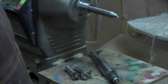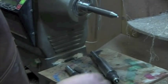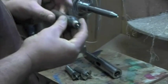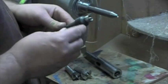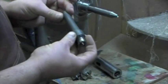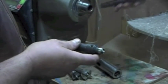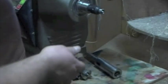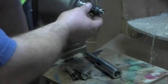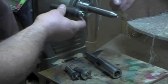The further you go out, the more vibration you have, but for spindle turning I find that's not really much of an issue. One Way sells a center — I believe they call it a safety center — and it has several advantages as well: it's got a removable tip, which the Jean-François one doesn't have. The disadvantage with the One Way is it's quite a bit closer to the headstock, which is a disadvantage for me with my lathe. On the DVR, the difference in the distance it sticks out from the lathe is significant.